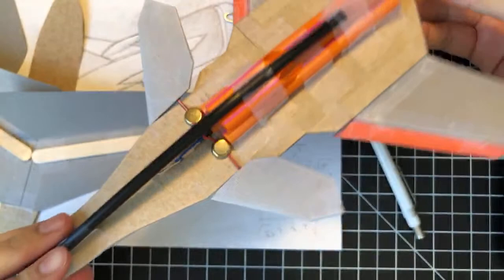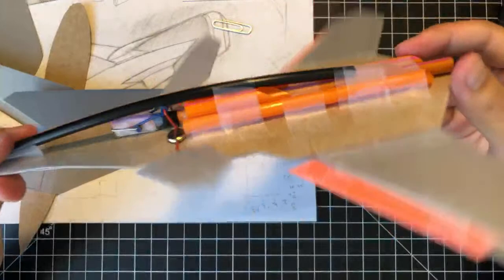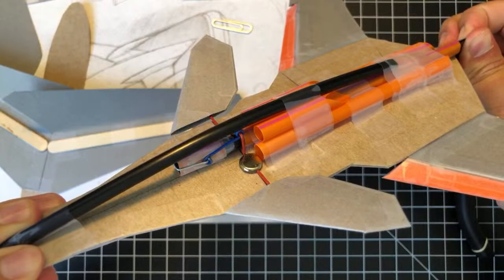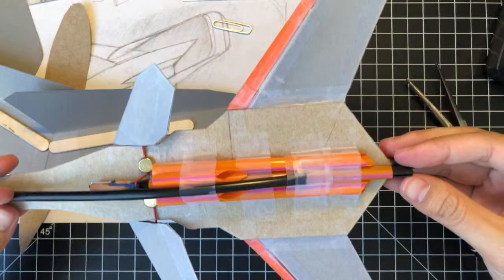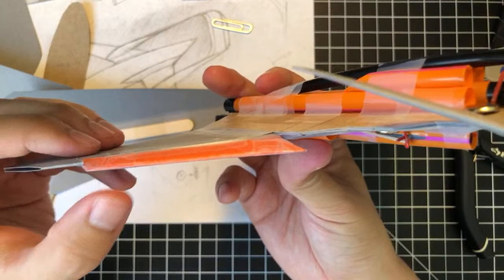So this is the YX 10 M1. I think I'm going to call it M1. I'm like 80% sure I'm going to call it M1 at this point, but this is a work in progress. You can see it retains the same mechanism design in the canard actuation, control surface actuation mechanism, CSAM, for the canards. So this is the same. And also in this prototype, there is another mechanism that actuates the leading edge slats of this design. So the slats actually move up and down.